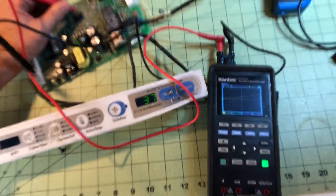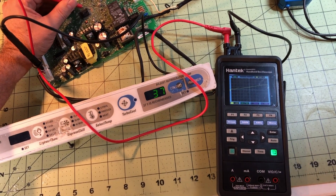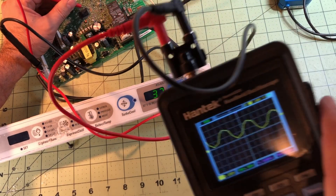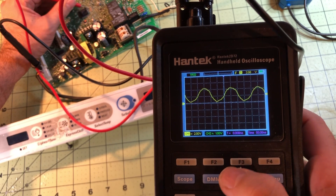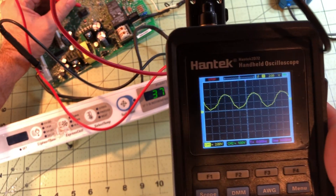Now we're going to look at the frequency for the microprocessor — not that you would really want to do this except for curiosity, but I wanted to see if this scope could handle it. This microprocessor operates at five megahertz. I'm on the pin but you can see it's not set correctly, so what you can do is press the auto button. It takes a moment, but eventually it gets there — based on the signal input it'll automatically do the settings for you, which is a good estimation of what that waveform looks like.